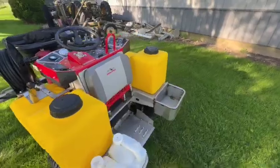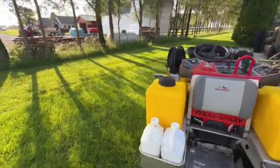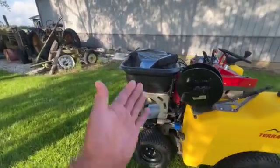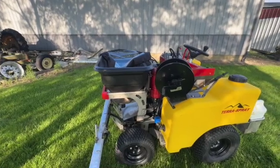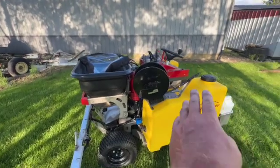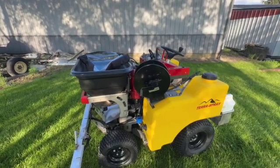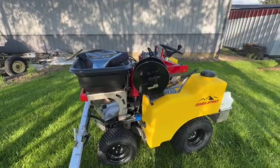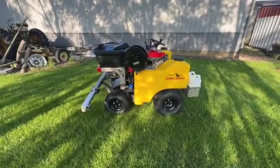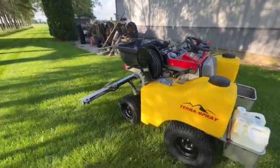The main function of this machine is to spread material. We have our hopper and spreader. Everything that was wrong — problematic cables — no more cables. Everything is controlled on the multi-function pad. Everybody says electronics go bad and cables don't, but cables do go bad. Cables are a major problem — sometimes they get corroded, they get stuck, they're never properly lubricated — so this eliminates all of that. The life expectancy of these pads is thousands and thousands of hours, so that is a huge advantage.